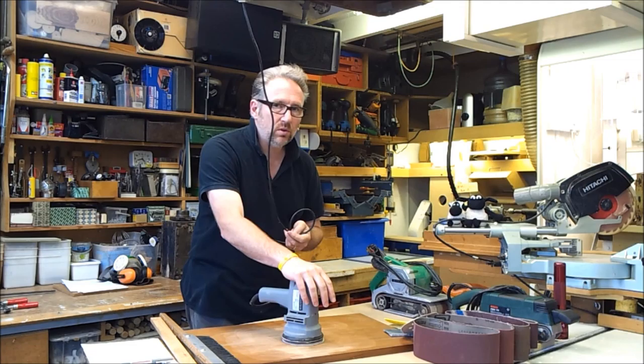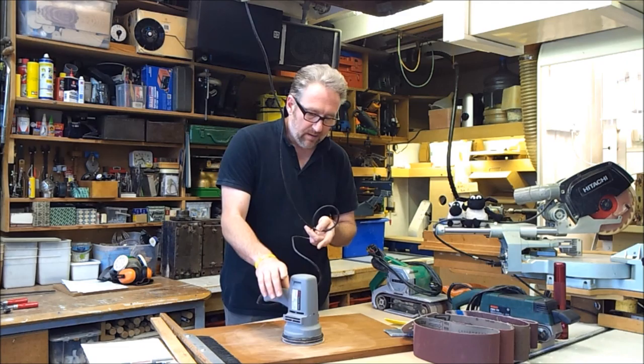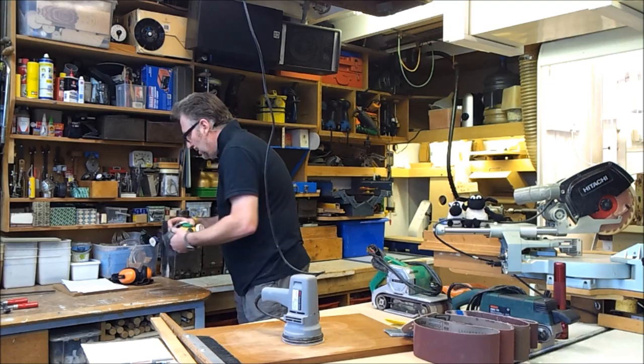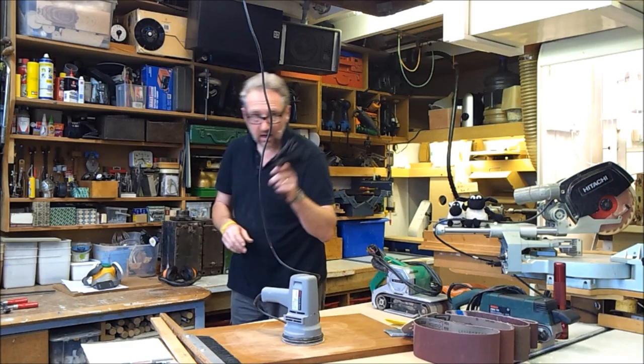From a DIY perspective, these orbital sanders are probably the most handleable kind of sander to get. If you're buying one and you're doing a lot of sanding, you're not going to sand down lots and lots of doors with this, but you do get a really nice finish. So if you're just taking off a bit of old varnish and you're left with a fairly rough surface having used some nitro-mors or something like that, offer a really good clean up to wash that away — using something like this, of course, with all the necessary safety equipment.